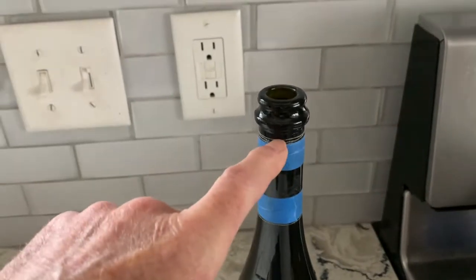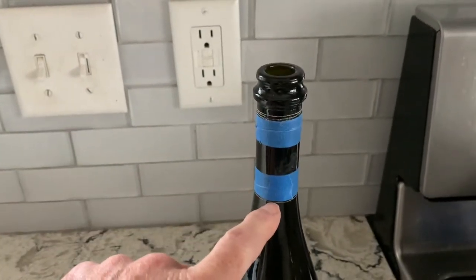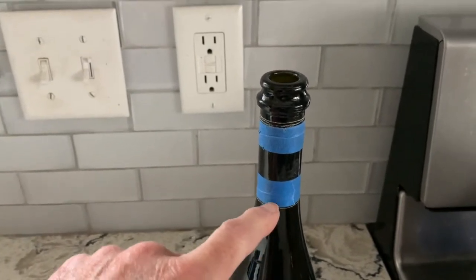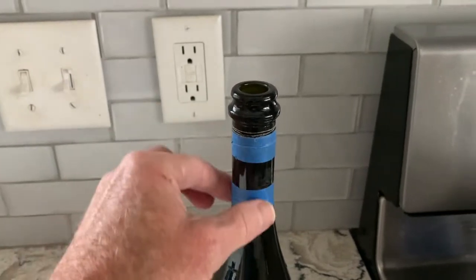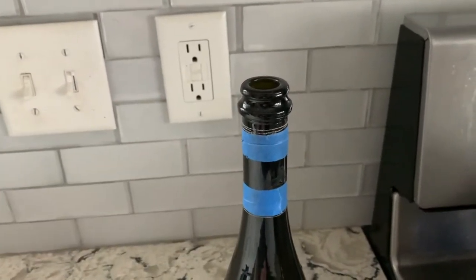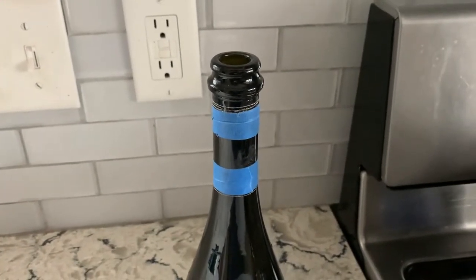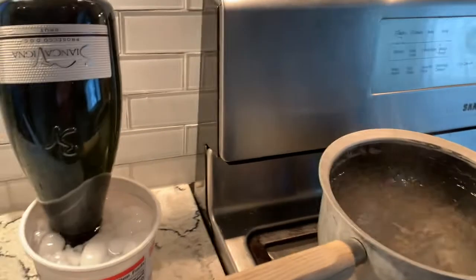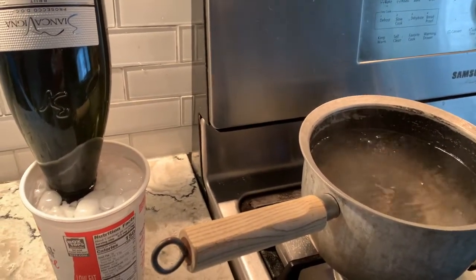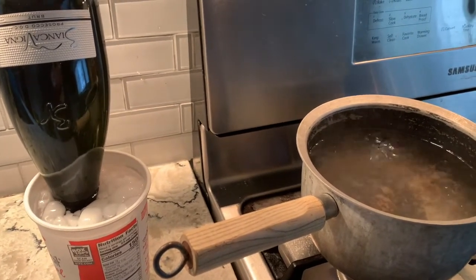I'm going to first try to shock it and knock the top off, then shock it to get the other line to crack second. The part in between will need some cleanup work, and as long as it's nice we'll have a really cool glass slide. The idea is to dip it into that first score line and shock it with heat and cold back and forth — we should hear a pop.